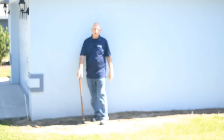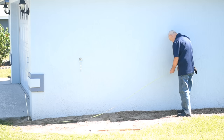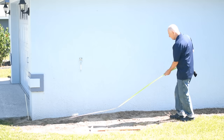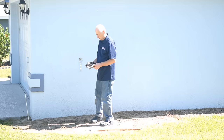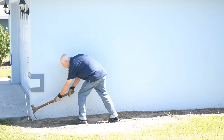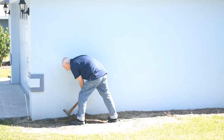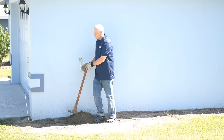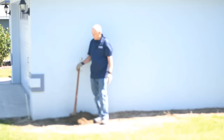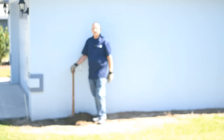So I'm going to make a little mark to know where my ten-foot section is. I always like to wear gloves when I do this. You want your trench to be six inches wide and about six inches deep — as you can see I did about eighteen inches pretty quickly. No sense in watching me do ten feet, so I'm going to fast forward through this.